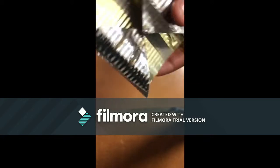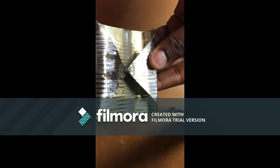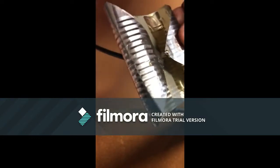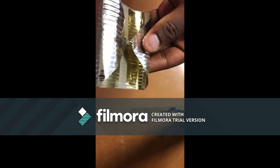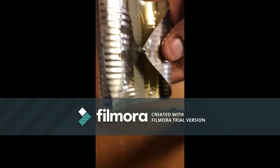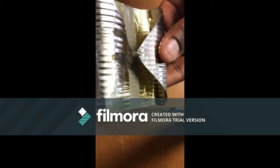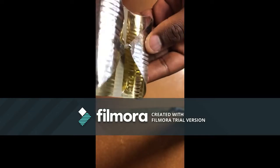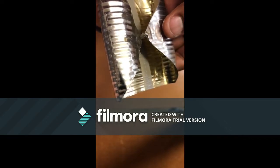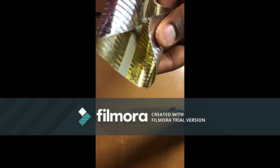After testing the antenna, the constructed self-grounded bowtie antenna radiation pattern shows that the antenna mainly radiates in one direction. This validates our expectation. Among some lessons learned from the project, the antenna testing performance depends on the testing method used. The antenna gain and its performance actually depends on the way the antenna is oriented to the signal strength receiver, the free space losses, and insertion losses. These losses affect the gain and the antenna performance.